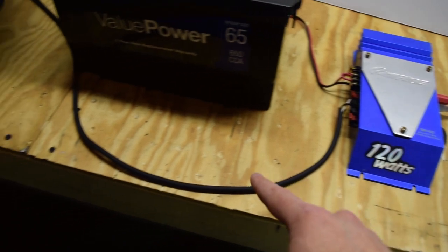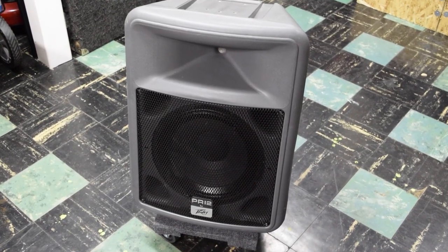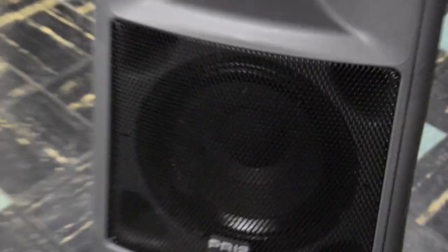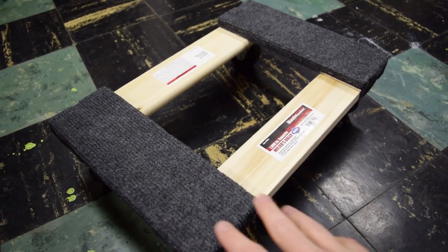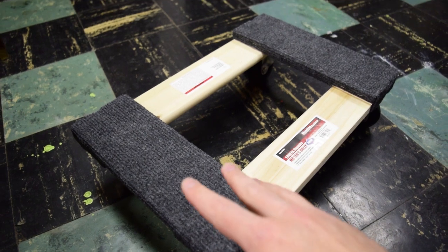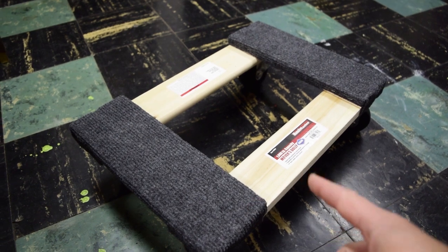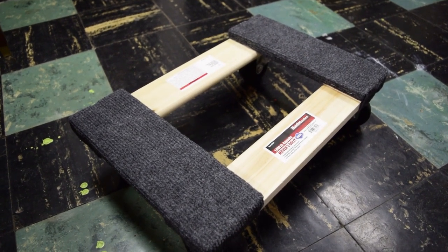From the car amplifier, the signal runs over a speaker cable to the PA speaker. This speaker is about 200 watts, and knowing our amplifier can only push 60 watts max, I'm going to change the 12-inch driver to a lesser wattage 12-inch driver so the speaker doesn't require so much power. Then we'll be mounting the battery, amplifier, and mixer to this rolling dolly cart and making a box over the top to protect everything. The speaker will stack on top, making it easy to move around and easy to load into a vehicle.